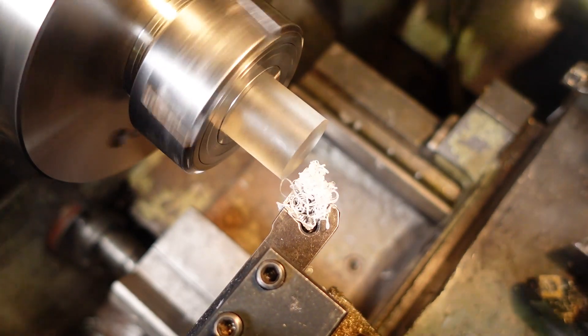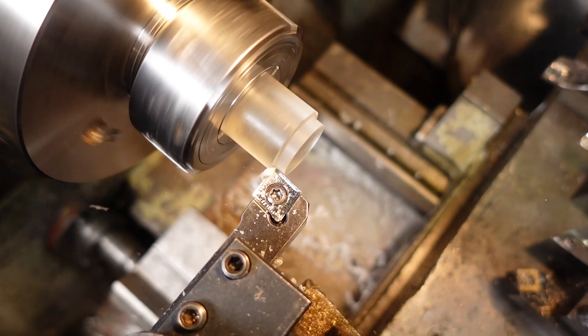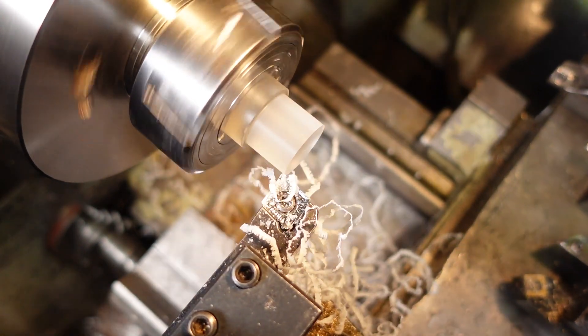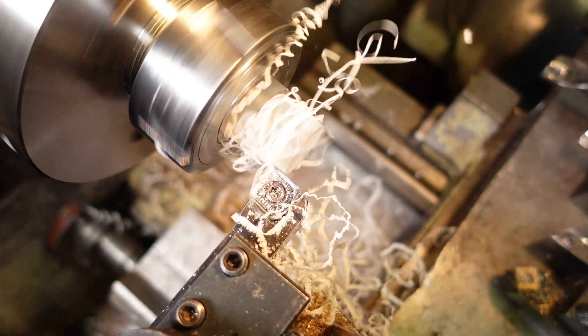The lens focuses the beam a little and reduces the side lobes of the antenna system. It's also neat because it fills the face of the waveguide tube and can be cemented in place to prevent water ingress.